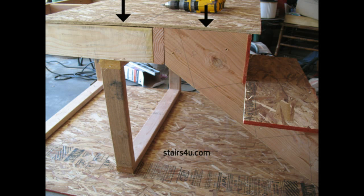In this video I'm going to explain how you can use a sheet of plywood or OSB to create an extremely strong structural connection between the stair stringer and the floor. In this particular method of construction, the landing sheathing will actually tie the framing members together — the stair stringer, the rim joist, and the landing joist or floor joist together simply by nailing the top of the sheathing.